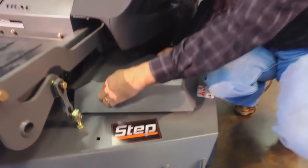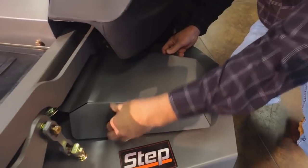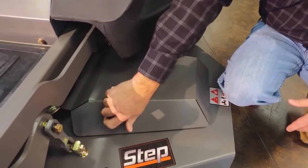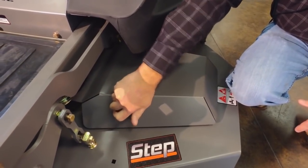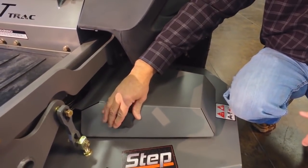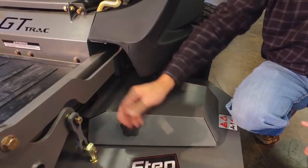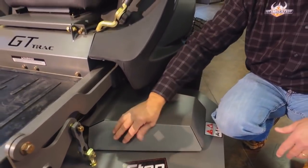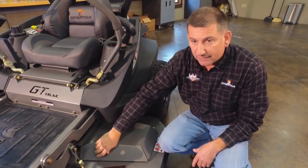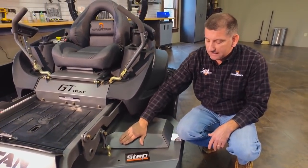for the pulley covers. It's got soft grip knobs that you just remove right here. There's a soft grip knob back here, and the reason we do this is these knobs are really soft, so that if it was to be cold or whatever, if you grab hold of something soft, it's really easy to operate. And then we had these brought up higher because everyone watching this that has ever had a commercial mower knows, when you get out and you have grass on it and it gets wet, these here will freeze up if they're mounted directly to the deck. So we raise this up. This is something you wouldn't know until 4 or 5 years from now, but we try to think of everything 4 or 5 years down the road. So you'll be really proud that it has a system right here.